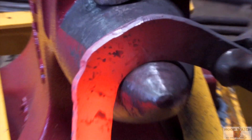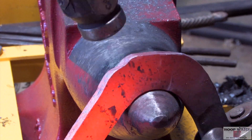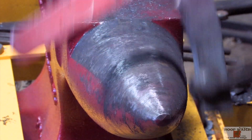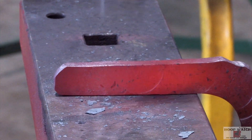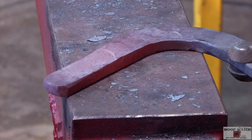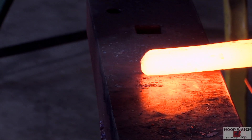I'm going to come here, stay out on the bick, go to that corner. At the same time, I don't want to hit the top — I want to hit with my round side of my hammer, bringing that up onto the anvil on the horn. Then I have a place where I can start making contact with the face of the anvil. Flatten, flatten, flatten. This shoe will be flattened from the time you pull it out of the fire until the time you put it back in the fire.